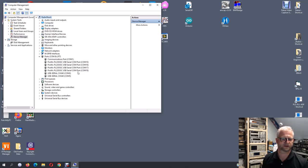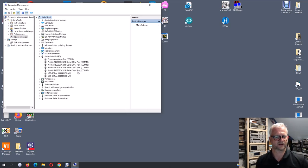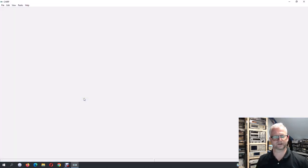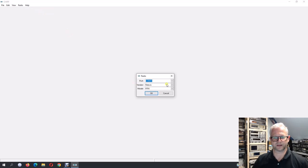Here we have it already. Okay, I didn't see. So it's 2 or 5. So let me plug this out again. Okay, it was number 5. Okay. Good. So we have them all here. Remember, it's COM5. So start our chirp. I will leave a link for this because this is great software, because it just has any radio. So if I just say download from the radio, always read first. And we need to switch this to COM5.